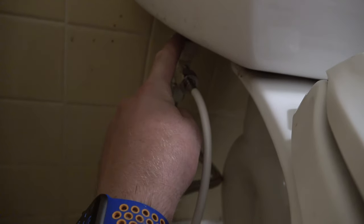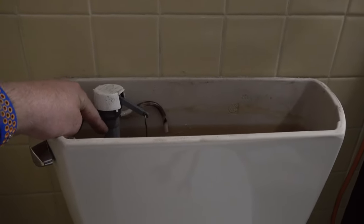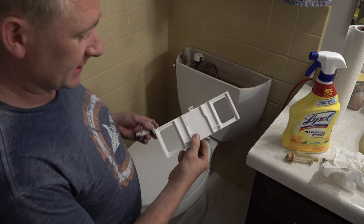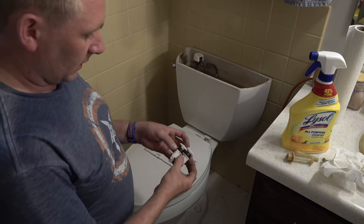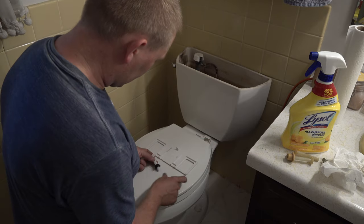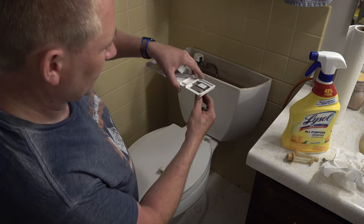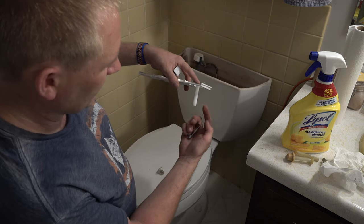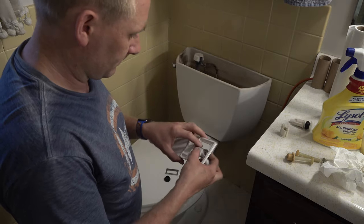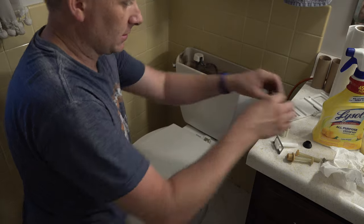When threading onto the actual toilet tank fitting, you may need to take the lid off and hold the fill valve so it doesn't spin with you. Now before revealing the toilet and starting the seat mount, let me show the back plate. It mounts back there and the bidet slides into it. These are the bolts — the nut is pre-installed with a rubber washer on the bottom side. You take the nut and washer off, drop the bolt through the porcelain hole, then reinstall from below. I want to clean that area before we start mounting.